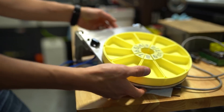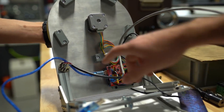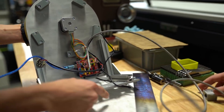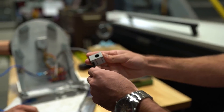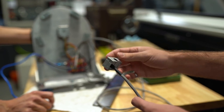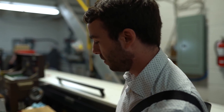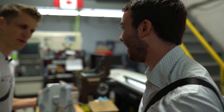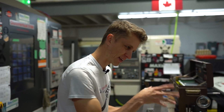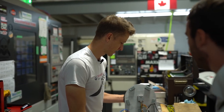There's a stepper motor driver on there. If you want to sort of tip it, just some simple wiring. An 8-position rotary switch into the shield, and then there's a cable here which plugs into this current switch. Every time the conveyor motor goes on, it's going to trigger this to count a part in the bin. And when it gets to whatever we set it to, it's going to rotate that one-tenth of a revolution. And reading your build document, you already figured out that the conveyor turns on for like 45 seconds, so you need a signal — not a constant AC pulse — otherwise you'd get it counting 60 parts a second.